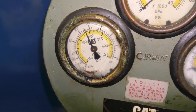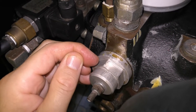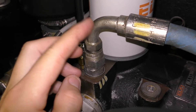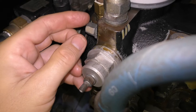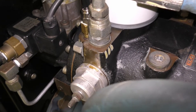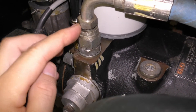We did see this gauge, which I left hooked up to the tank, drop from that original minimum pressure valve setting of 4 bar that I set. That makes sense because inside here was a big strong spring with a piston on it, and that piston has a little weak spring that pushes on the non-return poppet. Any pressure that we generate here at all has an effect on that large spring and pushes that big piston back, which then reduces the holding force of the poppet against the seat. John Graham who left the comment is absolutely right - you're not seeing the minimum pressure valve setting the way I was doing it before. You must have this vented to atmosphere with no restriction whatsoever to actually set the minimum pressure valve.